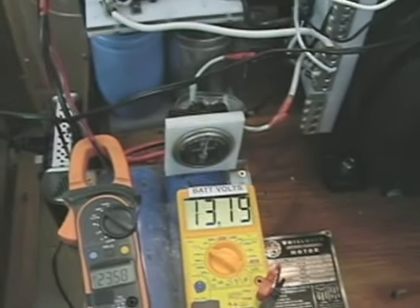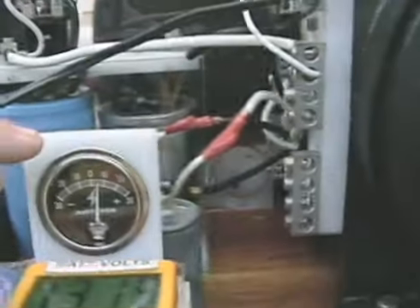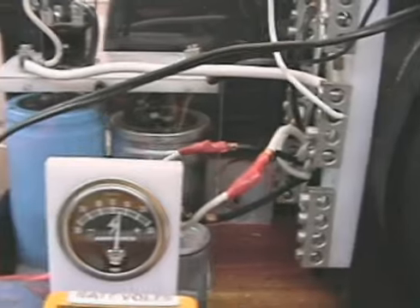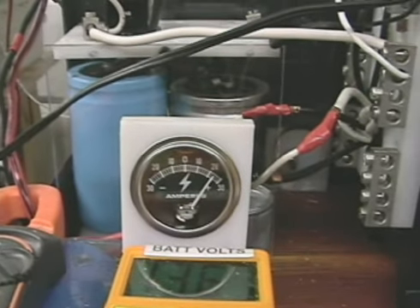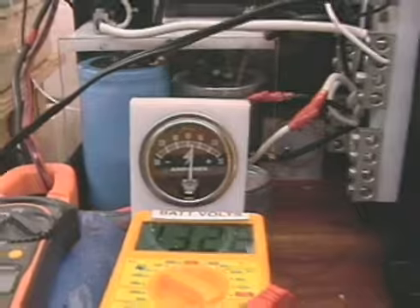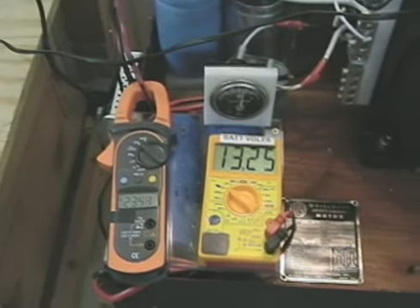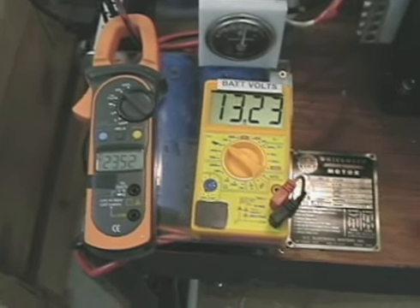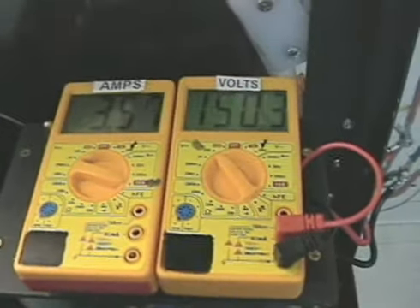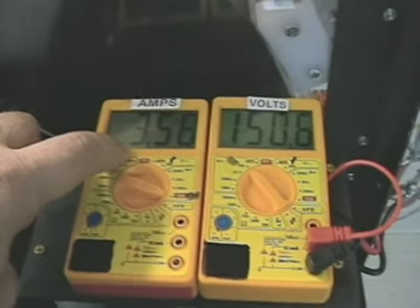At the start time, if you look at this meter here, it's just a little bit above the plus side, because I'm basically bleeding off some of the energy. My current bulb's off — you can see that's actually what goes to the batteries. At the current time I'm bleeding some of it off so I can shoot this without trying to drain eight 44 amp-hour batteries. The input is 120-volt line, but it's showing 150 volts at 3.5 amps.